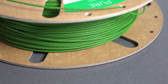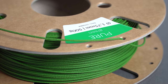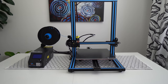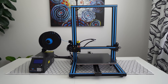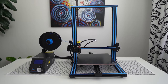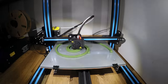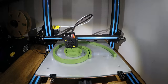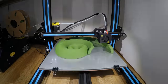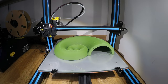For printing the speaker enclosure, besides filament and STL files, you need a quite big 3D printer. My personal recommendation is the Creality CR10S, which is a fantastic 3D printer for its size, print quality, and price. If you are into 3D printers, make sure you check my Creality reviews on my channel. For printing these speakers in any wood filament, slow printing speed is the way to go, as high print speed can lead to nozzle clogs because of the high percentage of wood particles inside the filament. So this can take a while.